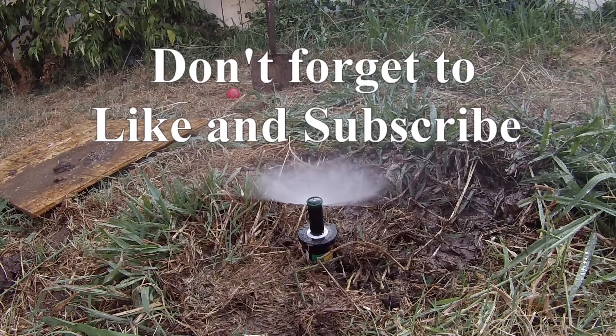That looks good. The next step is to turn it on and adjust it. Once your sprinkler works, you can turn the top of the head — since this is a zero-to-360 model — just the green part, and keep turning and adjusting it until you get the correct swath. That looks about right, and it looks like it's at the right height — it's just spraying over the grass, so that's perfect. We're gonna go ahead and put the grass back in. We got it all back in and aimed correctly.